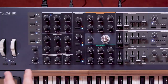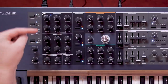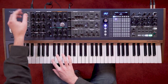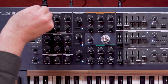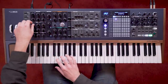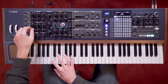These multi-waveform oscillators are configured to allow quick generation of really unique sounds. Both oscillators have independent tune controls, and they behave slightly differently. VCO 1 is two octaves up and down, quantized to semitones. VCO 2 is defined by its settings menu, but by default it's a fine tune with seven semitones up, seven semitones down.